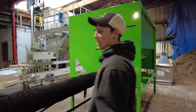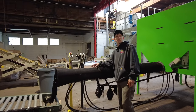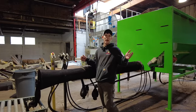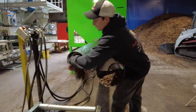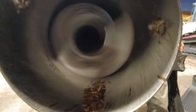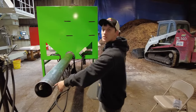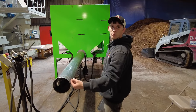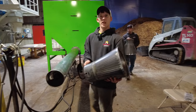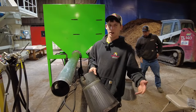When I run the stem, what I do is keep consistent tension on the sock — that way when people unload the pallets they're not stretching it out and they're getting the size that they ordered. That auger runs the whole way to the back of the hopper, the vibrator keeps the material falling down to the auger, and then the auger pulls the material out and puts it in the sock. We have different sized cones for the different sizes of sock, which gives you the correct diameter.